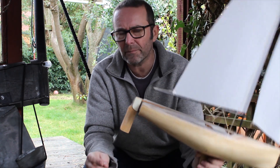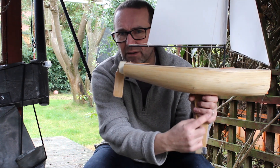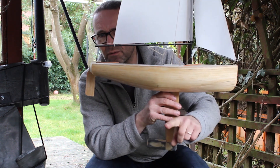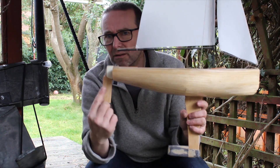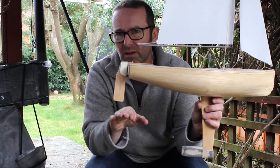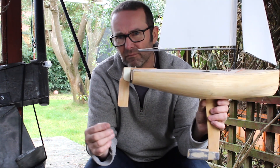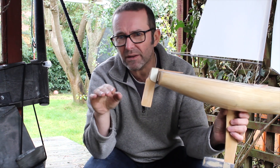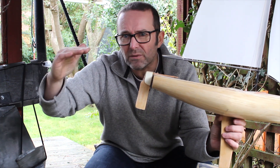So that's the second point. Now the third thing: the water flowing around the boat starts off at the surface, gets pushed underneath the boat, around the point of maximum depth, and then slowly comes back up again to the transom, where it gets back to the surface. That water going underneath is effectively getting pushed down and then coming back up again. Which means the foil in the water — the water it's going through isn't travelling dead level, because the water's coming up.